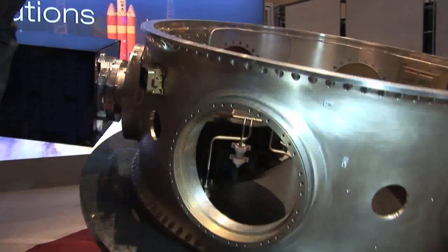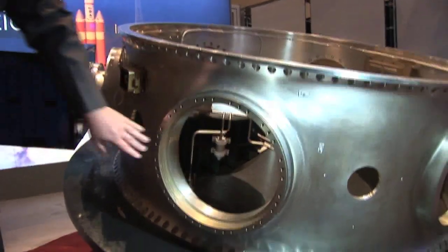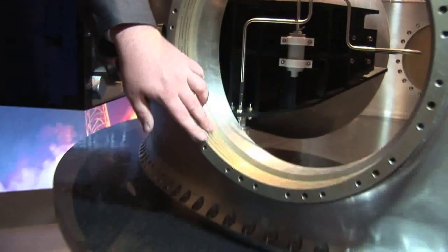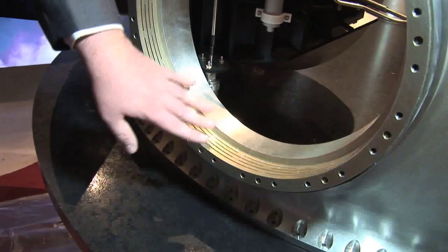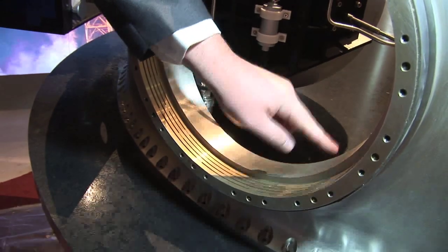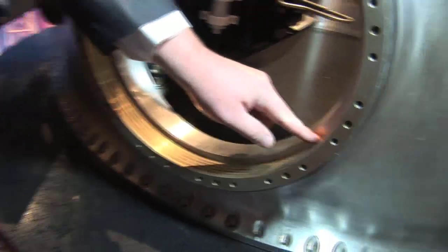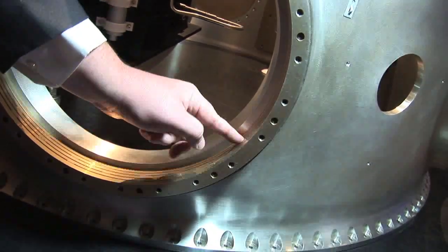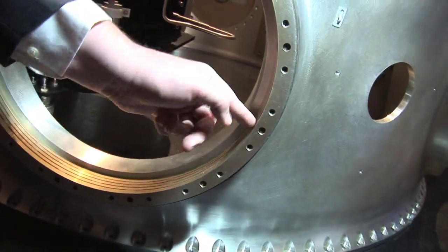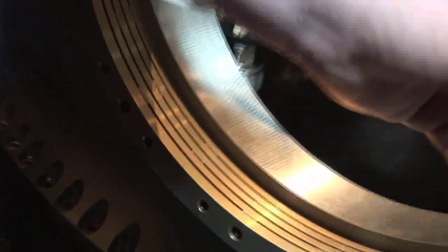One example of shock mitigation is this thing called the shock ring, which doesn't seem very elaborate, but there's actually a lot of engineering behind it. It's got a proprietary material spaced at certain intervals. If you pretend it's a maze, shock would have to vibrate through here, then transmit through the material here, then here, then here. These little spacers are a special material to help dampen out that shock.